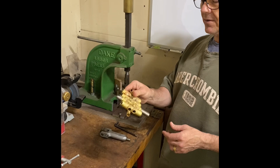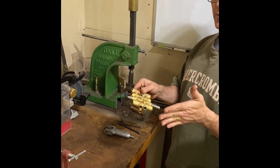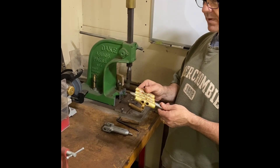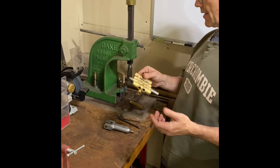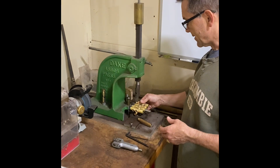I've got a steel mandrel inside of the valve set. This is between machining steps two and three. The interior of the casing is opened up to 629 thousandths of an inch; the mandrel is at 625. This is when I'm going to stamp a logo on the valve set and then a serial number.